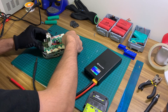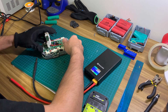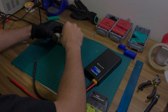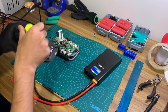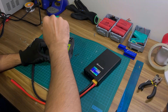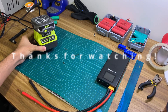If we're all good, now we simply put everything back together again. I recommend reversing the steps we took to disassemble the battery. So place the batteries in the bottom ensuring the heatsink is in this little room. Place the rubber pieces and metal spring tabs back on. Place the top part onto the assembly and test in the tool. Now that we're all good, we can screw it back together. You can test the battery in a charger. And we're all done!